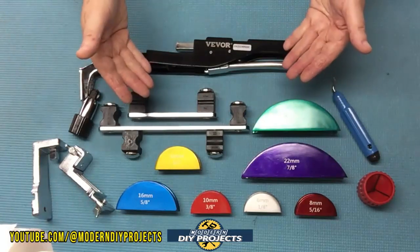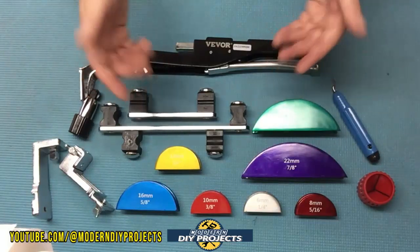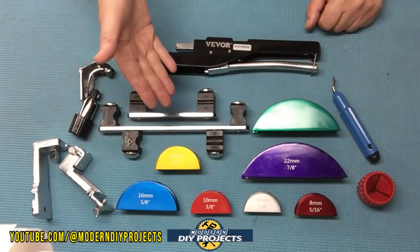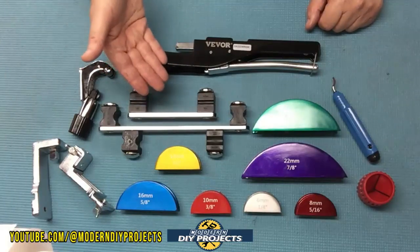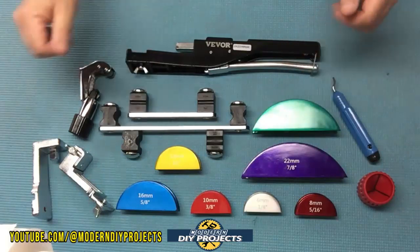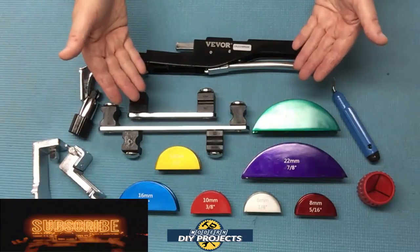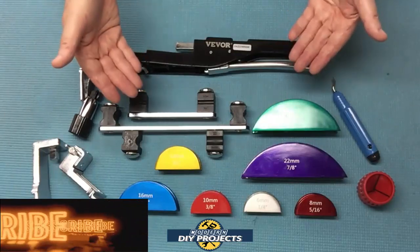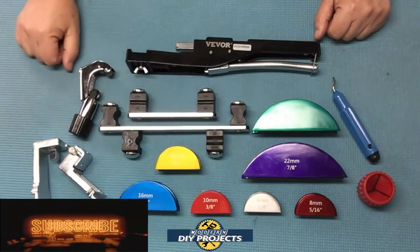It was a little more difficult for me because I had to keep the actual bending in frame so you guys could see what I was doing. After doing a few pipe bends off camera, I would also suggest using a little bit of grease or lubricant to help the pipe slide a little easier when bending it. Also, for thicker pipes, some folks may suggest heating up the pipe to make it more malleable. I'll leave all that up to your discretion.